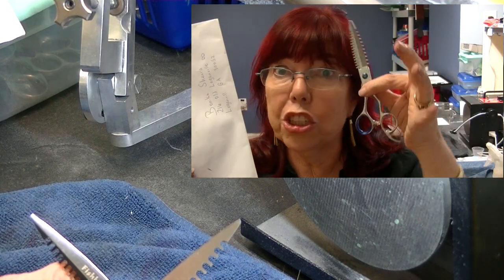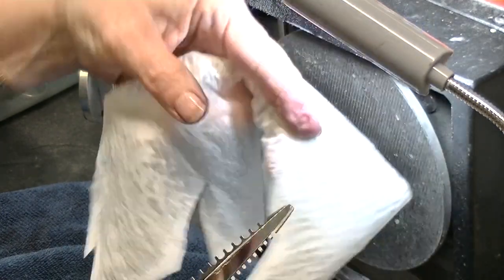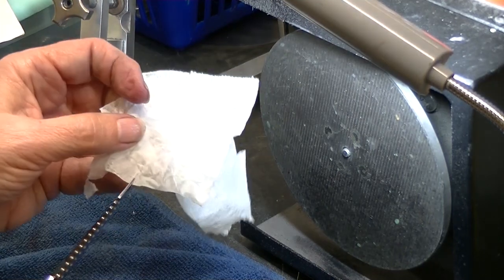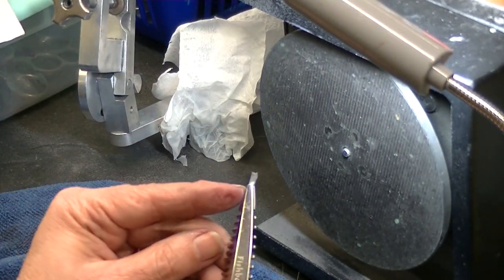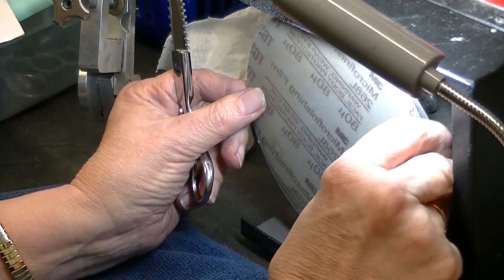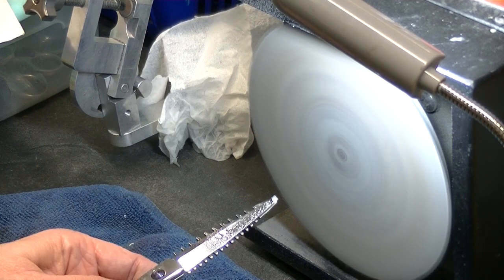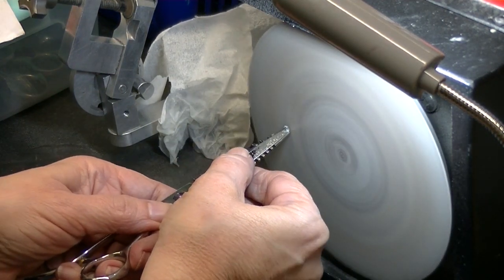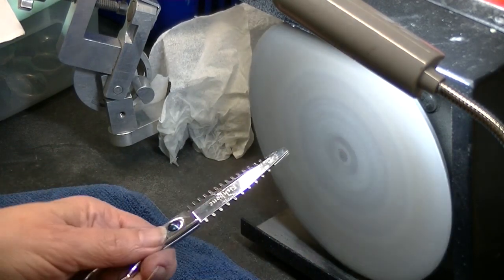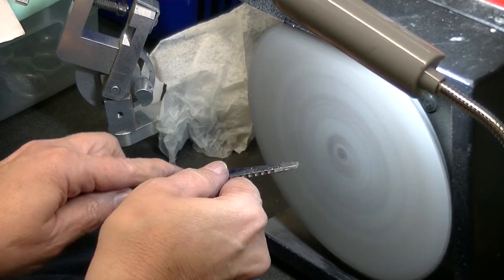They cut perfect except for the tip, so I'm going to shorten it. The best way to do it — I've got a little piece of paper in here, and when it gets to where that pops off I know I've taken off enough. I have a fresh 80-grit — I think it's going to do better than the worn 100. I'm going full speed and I want to wet it because this is where it'll get hot. I'm going straight in at the tip, and after I get it down past the damage I'll round it off.